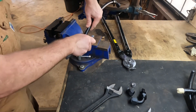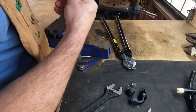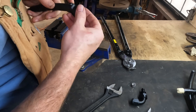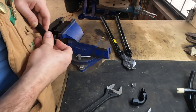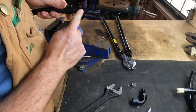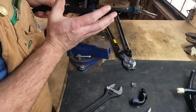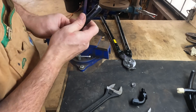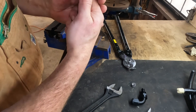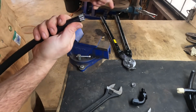You should be able to flick that plastic open. I forgot again to put the nut on — it's best that you put this on before you slice the plastic, because once you take the plastic off the stainless steel braid will open and then it's difficult to get the nut on. So first put the nut on before you cut the plastic.